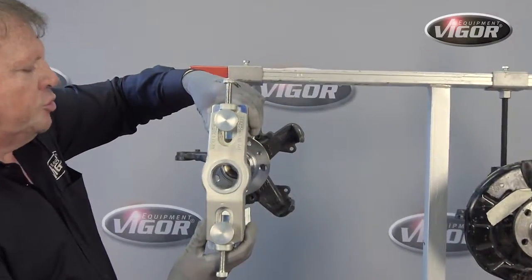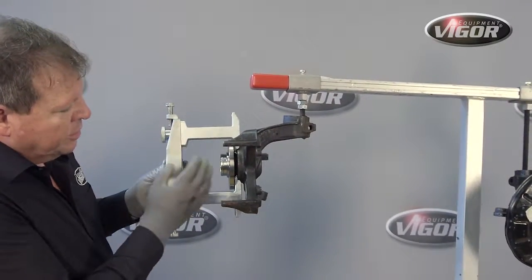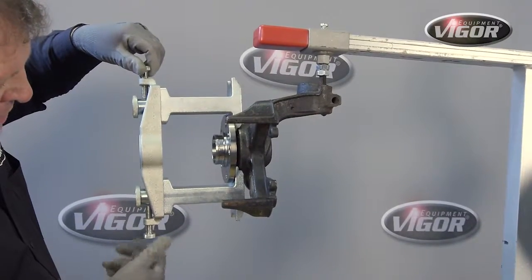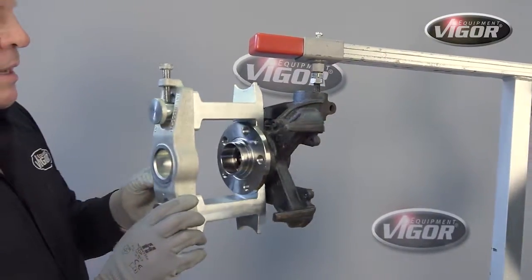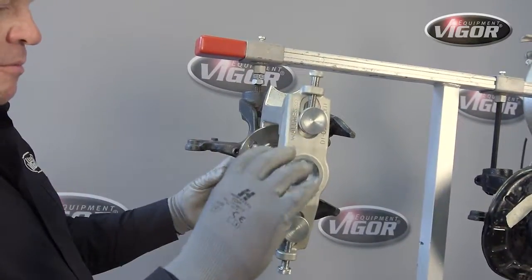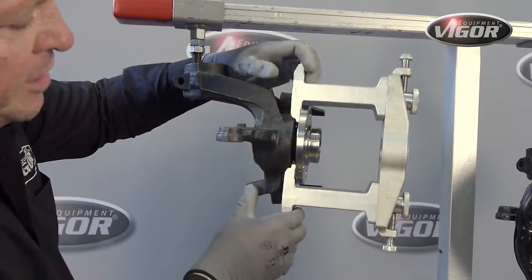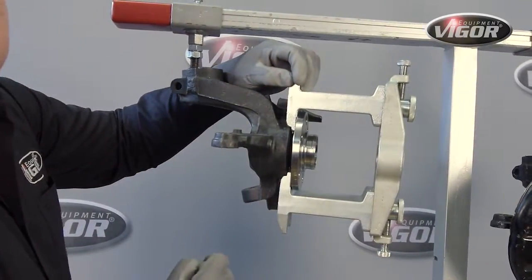So quite simply, start at the top, locate the top. Further, it's important to note that our location on the flange is even, so that the gap at the top and the bottom is about the same, and then we can set the screws to fix them in place, and now I have a nice parallel setup. Next, I'd like to show you from the front. You can see everything is set up from the front, and from this side it's important to note that the feet are pressing flush against the flange. The tool is adjustable, you can move it around, and it's seated against the flange.